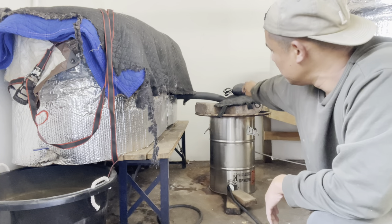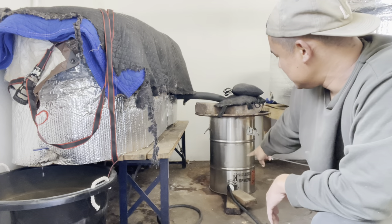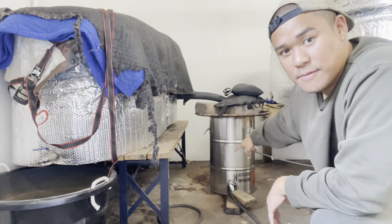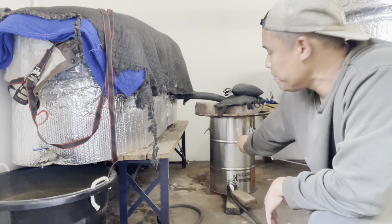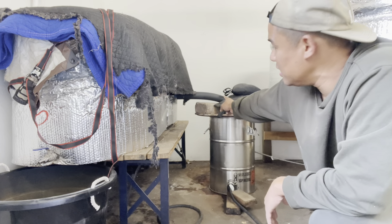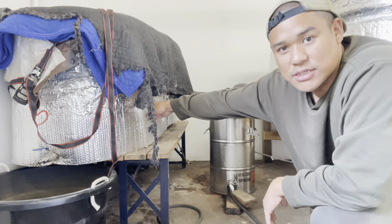We tri-clamped a hose from the lid to the trough. Now water is fed in from the line, the heating element heats up the water, steam is created, pushed up through the lid onto an insulated high-temperature hose, and it gets fed into the trough. That's the basics of steam pasteurization with the steamer barrel.